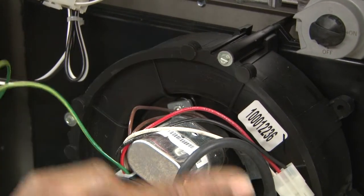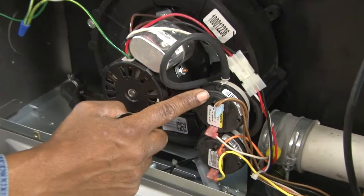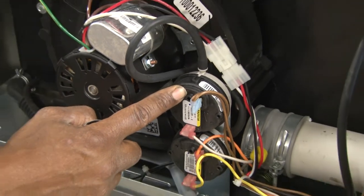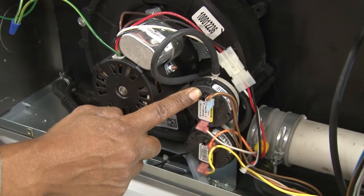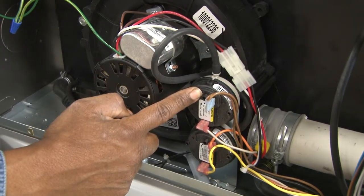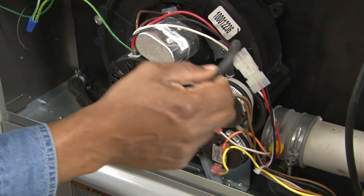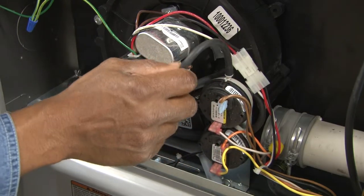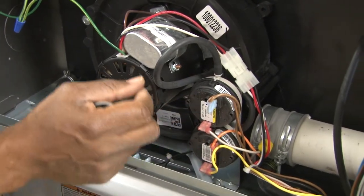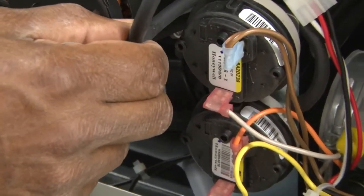Also part of this is safety. There are pressure switches to allow the system to sense that there's airflow through the flue gases through the combustion chamber. If there was no type of safety and the blower didn't operate, it could cause the flame to overheat the furnace and cause destruction. So this is actually sensing movement of airflow through the combustion chamber. This particular one has two different pressure controls — one to sense positive and another to sense negative pressure — and it's connected to different parts of the combustion chamber.